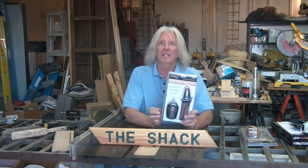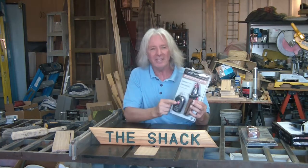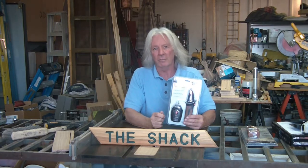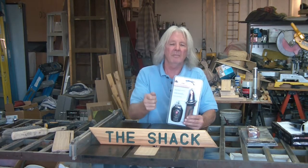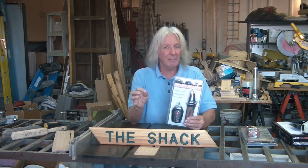These are almost vital for any homeowner. You can plug this into an outlet, take this over to the circuit breaker panel, and I will demonstrate it. Run it up and down. When it beeps, that's the breaker.